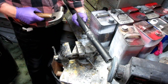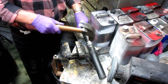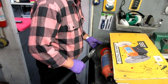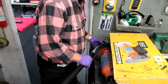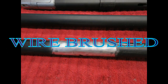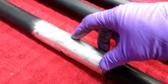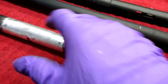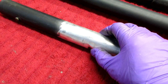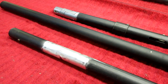This is the part that's really kinked. Before I put carbon fiber over the top of that, I want to round it out as much as I can. Before I do any JB Welding, I need to get the finish off — get the paint, powder coating, whatever it is. It's a very simple job for the rough wire wheel. This will go five minutes of video down into 10 seconds. We got that roughened up just enough. This is going to have to be carbon fiber. But before I do that, I want to spend some time figuring out how to get that cord up through.